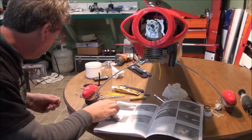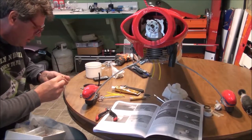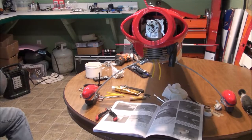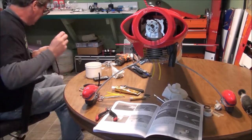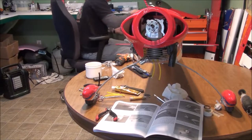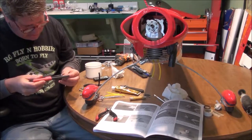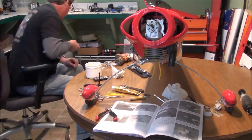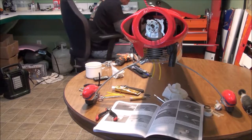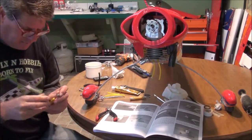I'm going to put Loctite on these anyway, even though I have lock washers and flat washers. Now I need to go see what size Allen wrench these are. They use standard and metric on everything on these models and they switch back and forth. It's very common to have a kit that has both standard and metric. Just always check and see what size you really need — make sure it fits the head well.